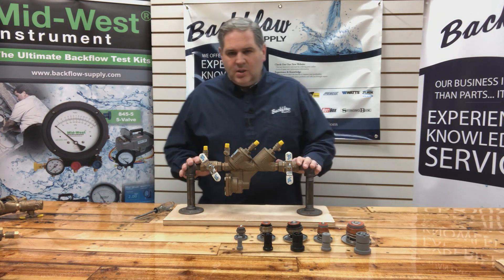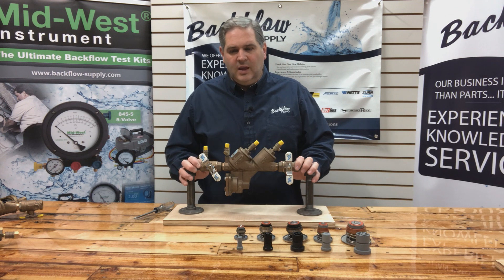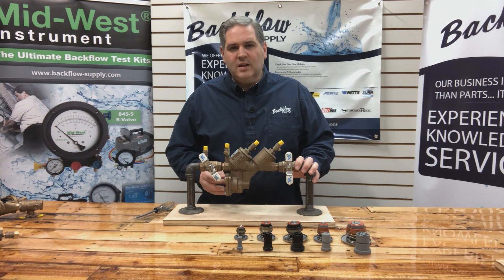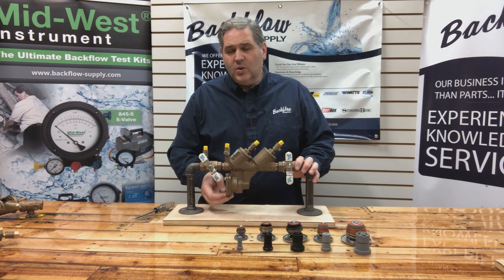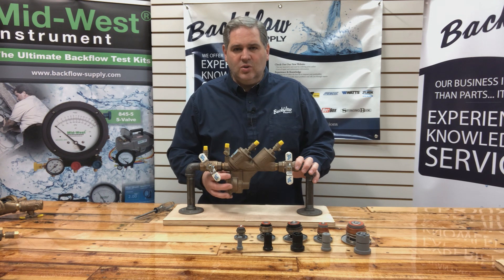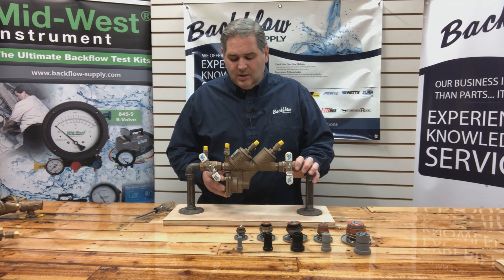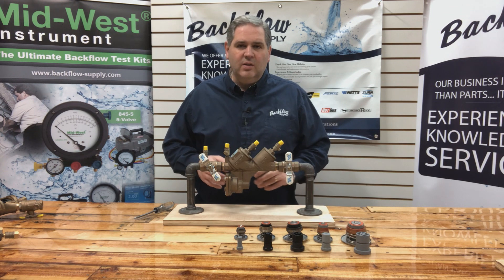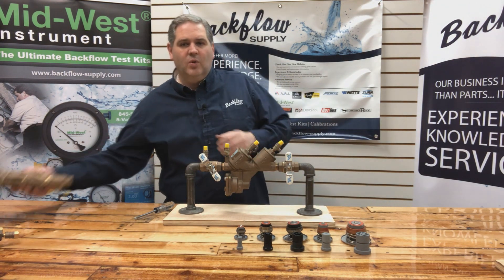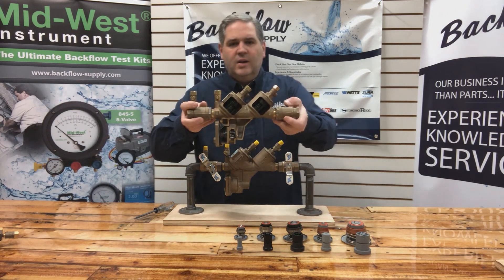Today I want to talk about the RP-4A and draining the relief valve. We've already gotten to that time of the year and many of you have probably already blown out your sprinkler systems, but I think this is important enough that you ought to watch this and make sure that on your model you did get the water out of the relief valve. There is no way to blow the water out of the relief valve area of the RP-4A — and this is a cutaway of it.